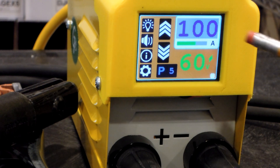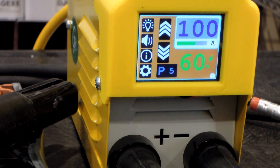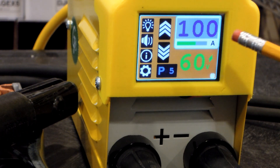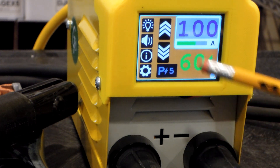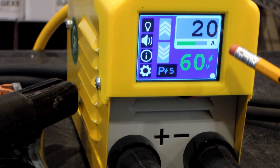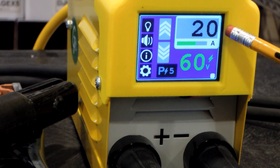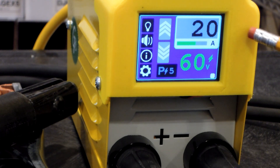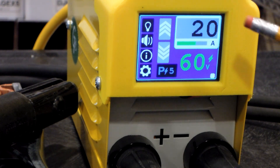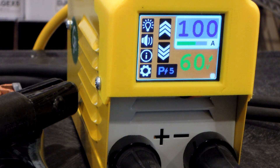If you're going to be making some changes to your setup and you're on the table with the sticks, you can decrease the current to make it a little safer. Just press that button and it'll suppress the current down to the minimum, which in this case is going to be somewhere around 20-30 amps or so. Then once you're done messing with your setup you can go back to full current.